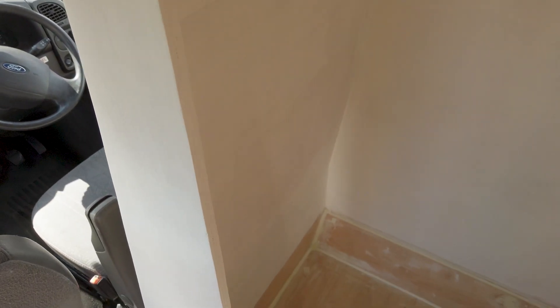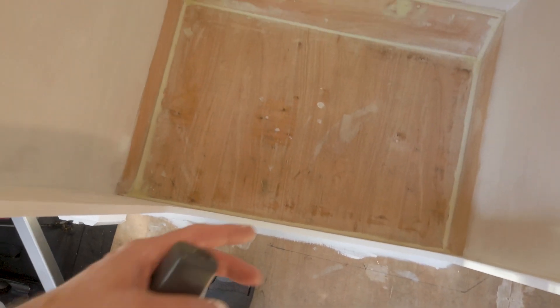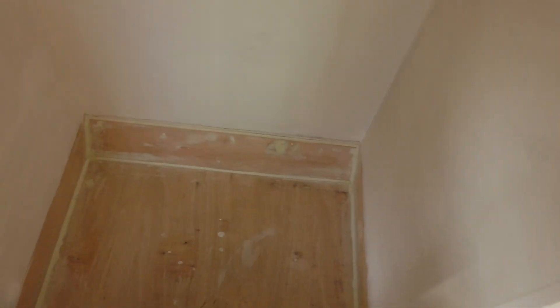It's afternoon now - it was about five past one by the time I'd finished and packed up last night. I did get another bit of filler on so I was ready to sand, and did some finish filling this morning. I've sanded and fine-filled anything that needed it. I got the base angle in and then the round-overs, so I can lay my fiberglass in now. I just need to get my hole through for the waste pipe. I'm going to put that in and try to do both holes because I want a waste for the sink as well, then get a tank on underneath. It's got a nice shape to it.